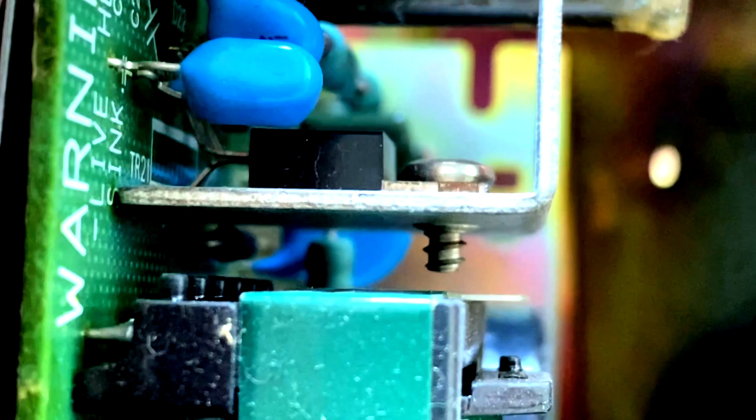It's a good idea to make a note of all these different wires and where they're going to go. We'll be tracing these over: the yellow and greens, the red and blacks, and the red and whites. The yellow and greens go over here — this was for the internal SCSI drive, which is not present here; it's just loose in the case. When we get that hooked up, we're going to put yellow back to positive and green to negative. Behind it we see the red and the black for DC — that's going to go over here to the big PCB to the bottom left, that does all the work.